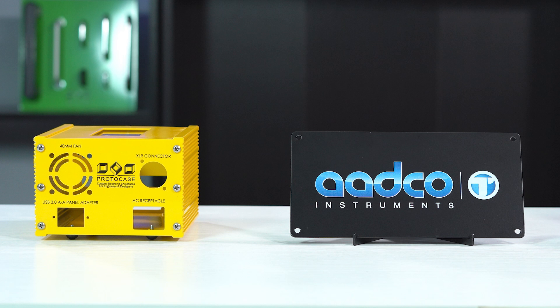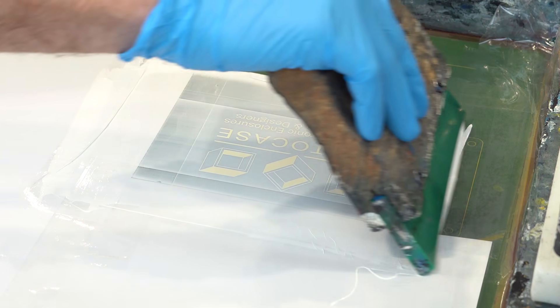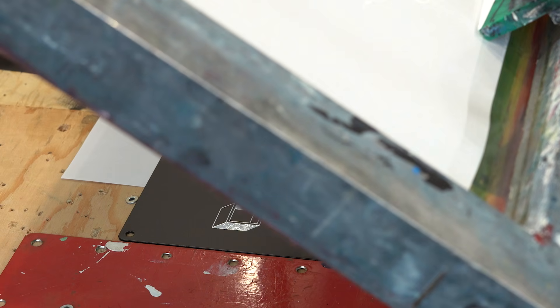If you are using a matte or gloss powder coat, we suggest opting for silk screening instead. Silk screen is ideal for smoother finishes, especially if you have smaller features such as thin lines or fine print. The self-leveling nature of the silk screen ink produces a smooth finish that is virtually indistinguishable by touch.